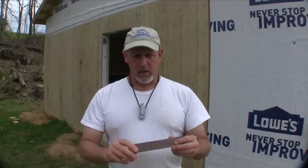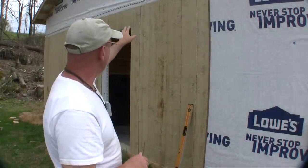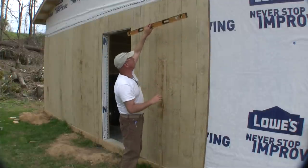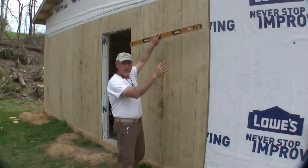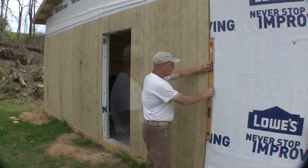Spend a little bit of time on the front end — that's what I've done and hopefully that'll save you some aggravation as you go. The way I'm tackling this is I'm dry fitting every piece before I actually nail it down. There's a skirt board on the bottom of this barn and I'm using that as kind of a guide or starting point, but I'm coming in and shimming it up. When you get a piece up, you want to make sure you're really square and level. I'm taking my level and laying it up there on that seam, making sure I'm running straight, running level, and making sure I'm good and square. Then I know I'm really good, really square, really level, and I'm pulling the sheet back off and going to the next step.